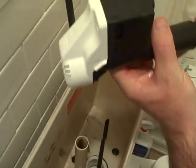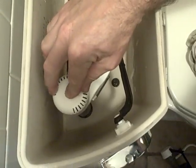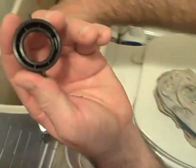To replace the new one, it's got this rubber washer. You're going to just insert it back into the hole. You also want to make sure — this is really important — that this is clean. If you get any kind of grit, any little plastic pieces or anything up in here, it will leak. So you want to get a nice dry seal when you put it in. I'm going to take the nut that they provide and screw it on. I'm just going to go ahead and hand tighten that — that's not going to leak.